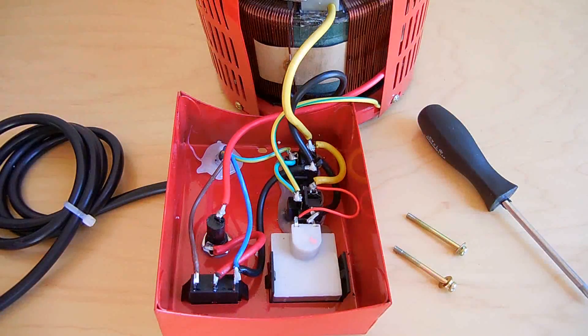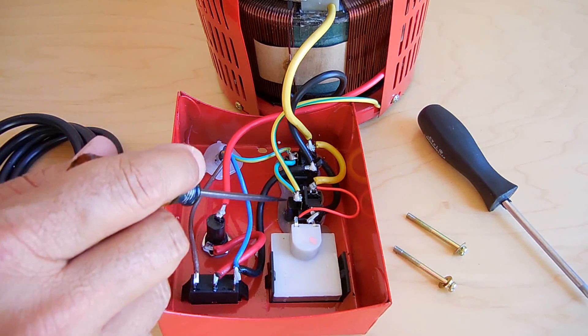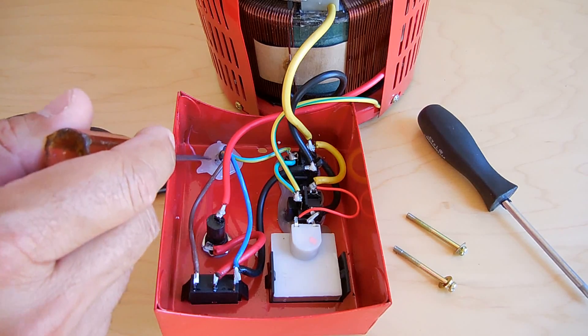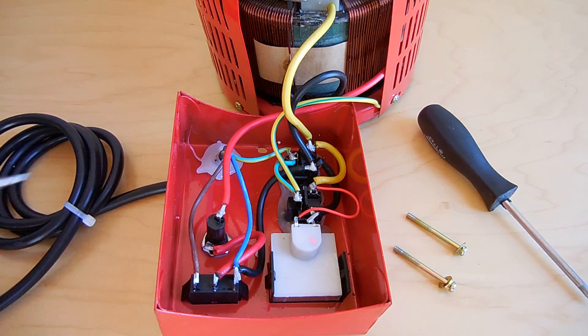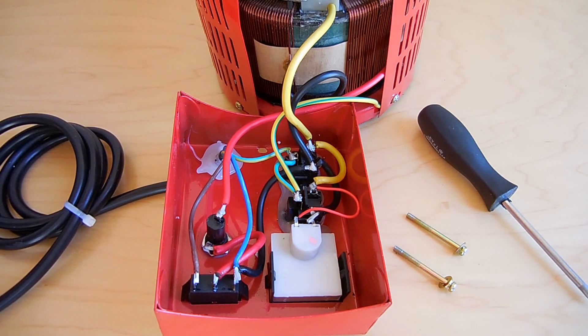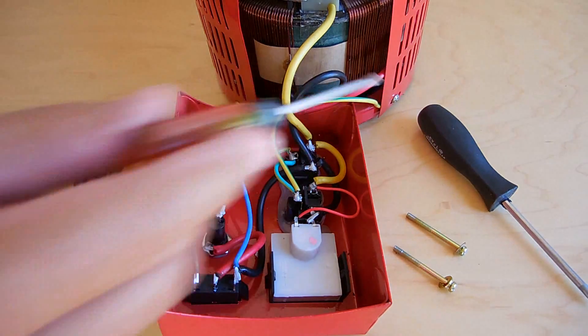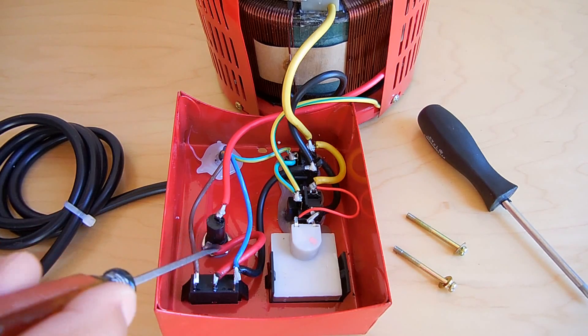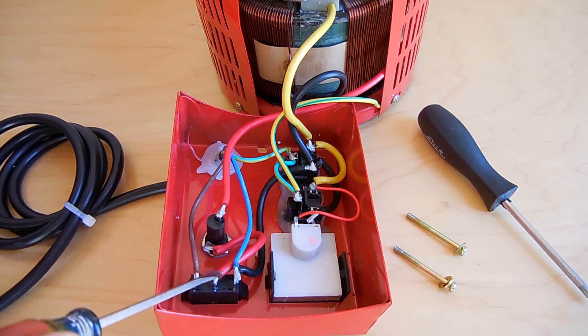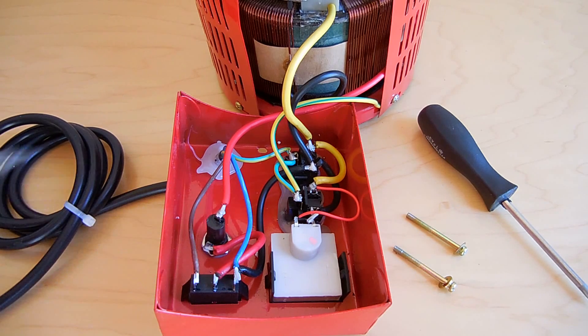Here's a look at the inside. The two receptacles are snapped into the steel. They applied some hot-melt glue around the cord restraint for the power cord as well as the receptacles — that should be fine, but I probably would have used clear silicone instead. There's a ground wire to each receptacle and over to the chassis, which is good. The wires appear to be soldered pretty well; the only one I'd apply a little more solder to is right over here — I'll heat that up with some flux and let the solder flow in.